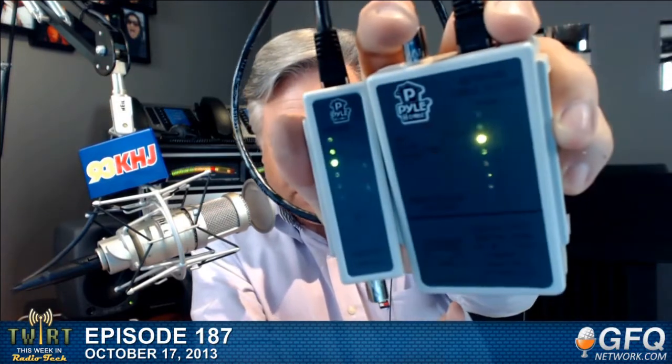It shows them. I actually made a cable here at the house a couple days ago, and I did miswire it. I flipped around the blue and the green white, and so I had a split pair. Well, this thing found it, but it found it by showing me one, two, four, three, five, six, seven, eight. So the green lights did not flash in order, and they only did it at one end. It only showed it at the end of this thing, and that meant that it was the other end that was miswired. I didn't read the directions for this thing before I started using it, so I had to figure out what that meant. But it meant that it was miswired at the other end, farther away from here. So there you go. For $8, goodness gracious, that's a perfectly good deal.